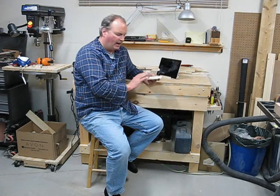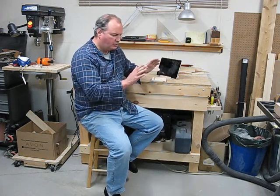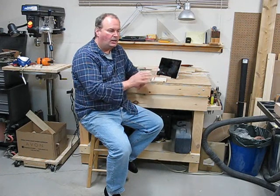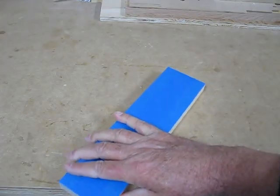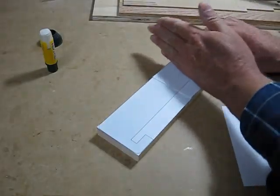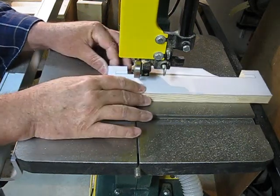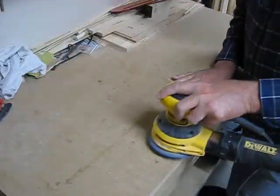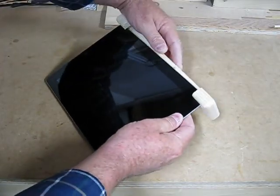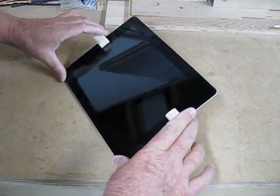Even though this is one of my more popular designs, you're limited to two angles — in my case 17 degrees and 40 degrees. Some people want to angle it a little more, a little less, or anywhere in between. So let me show you a quick way of making one on the bandsaw that will give you a few more angles. This simply fits on the back like this and pretty well goes to any angle — all you have to do is slide it down and it will change to whatever angle you want.